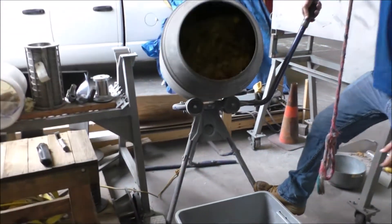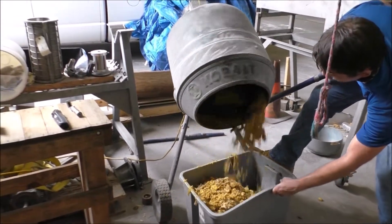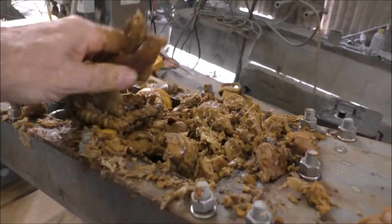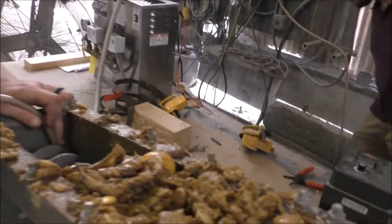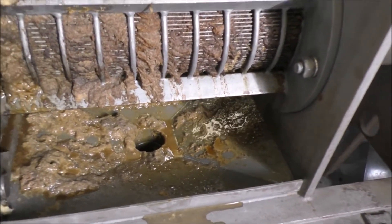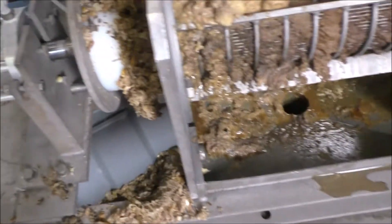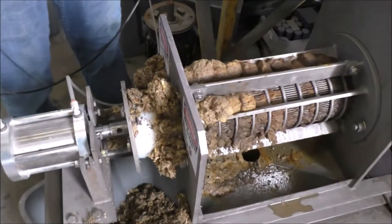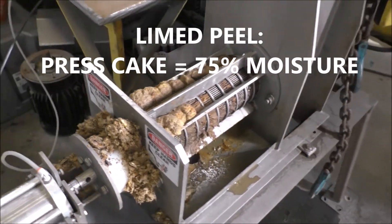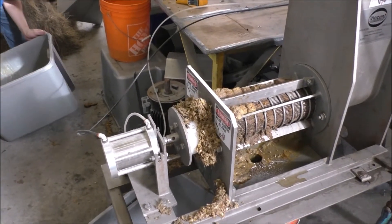Go ahead and dump her. So this is lime peel, but we have the boiler turned off. We're down to about 100°F — there's some residual heat from the metal being warm still. It's still a little warm to touch — warmer than bath water. Coming out, we're down to about 115°F. So it's cooled down. We're gonna run another 10 minutes, grab our sample. This is just plain limed peel with no heat added. And we'll compare that to the lime peel with steam added to it.